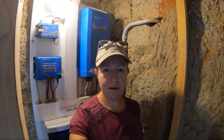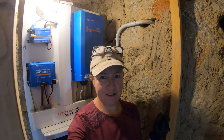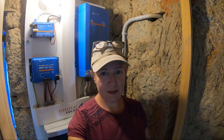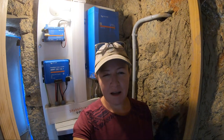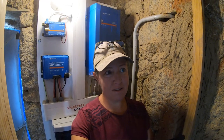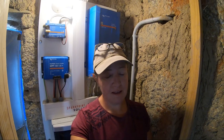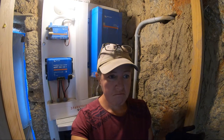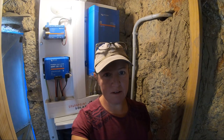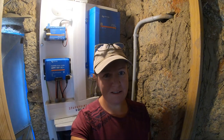Welcome to my closet. Something about what I've just done seems very strange, but I think it'll help me make the wall more vertical. I am slightly concerned that the pieces of wood going horizontally are a little too close to where the edge of the cob is supposed to be. I'm not concerned really about the heat coming off of the stove, more concerned about maybe the cob not really having enough to grip onto, but I guess let's just see what happens.